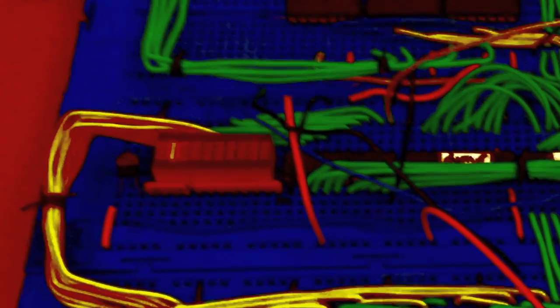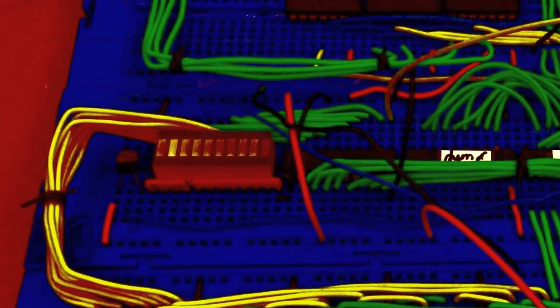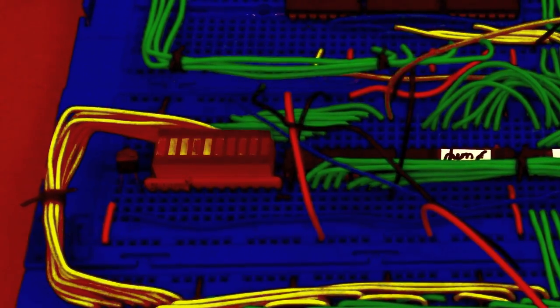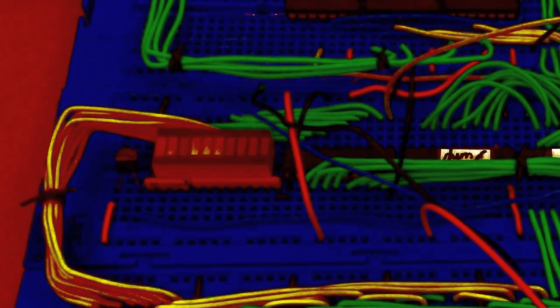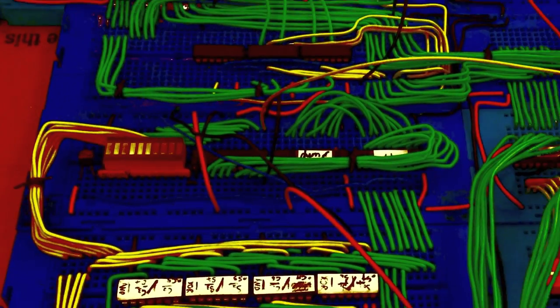As you can see, it's gone to two. We've got some switch bounce in here. This is a mechanical switch, and when we get an oscillator wired up hopefully it'll be fine, but for now it's not always counting just one. We're pretty sure it is actually doing it one at a time — we've put some discrete values in, just hardwiring it — but it doesn't always add just one at the moment, anywhere between 1 and 10.